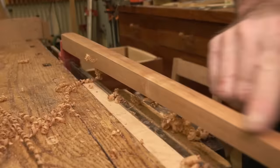About making a custom scraper that would enable you to be consistent as well. You could do that. That would be a very small grind. I mean, there are lots of custom scrapers you can buy. You can buy curved ones like this. This is way too strong of a curve. And to be honest, when I've used this, invariably you'll mistakenly dig in the other corner, and you're like, oh, why did I use this? But this is a cove that can work. There are lots of custom shaped card scrapers like this French curve. This is really helpful. We used it last week on the bowl. And then these are custom ground to scrape reeding, and that's made from a table saw blade. So there's lots of options, but I don't find it worth it on this because it's just a little subtle scraping and it's very fast.